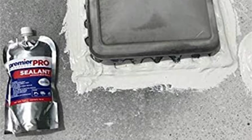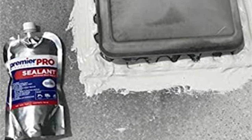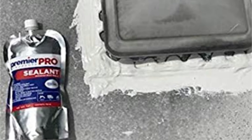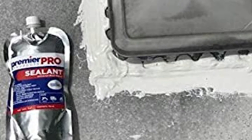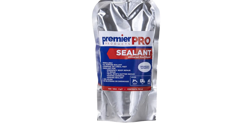You can reseal the pouch and use the remaining material at a later date. It has high tensile strength and sag resistance, and it's an excellent choice if you need to seal seams and bolt heads on metal and other types of roofs. It's also easy to clean up and wipe off compared to some competing brands. One drawback is that it can take a little finesse when squeezing the bag to get a consistent bead of sealer, and while self-leveling, it doesn't smooth out as well as some rival brands.